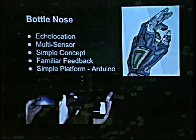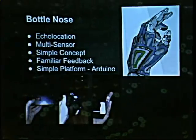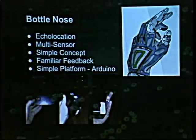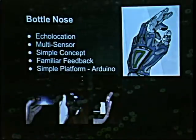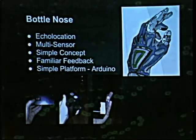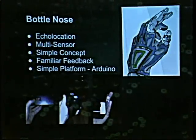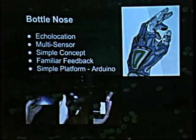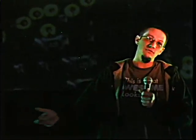We said, well, what would be an easy way to start this? So we took a range finder, which works on ultrasonic, and fed the range data into a microprocessor, then converted that to a delay signal for a pulse on an electromagnet — so as things approach the device, my finger magnet will actually vibrate faster as they approach and slower as they move away. Then you can sweep it around the room and get an idea for the landscape, draw a map in your head. You can close your eyes and walk around a room — I wouldn't suggest running with it, because you'll hit a wall.